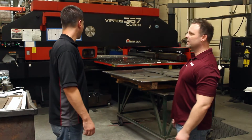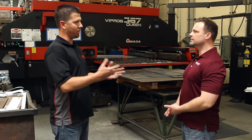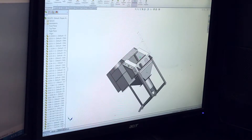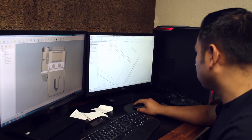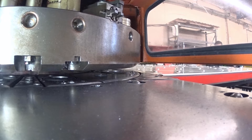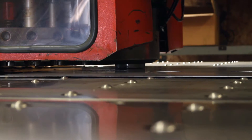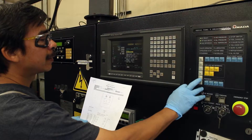Nathan, could you explain some of the equipment that's used in building the cabinets? Really a lot of it starts with the R&D and working with Iconyx and taking that to paper. The way we do that is with CAD programs and we also utilize SolidWorks, which is a 3D modeling program. After that, we would bring it out here — this is our CNC punch press. As the sheet rolls in under the punch press, you'll see it's rotating and selecting a tool, either shearing out or punching a hole in the material, following the program that was designed in the engineering office.